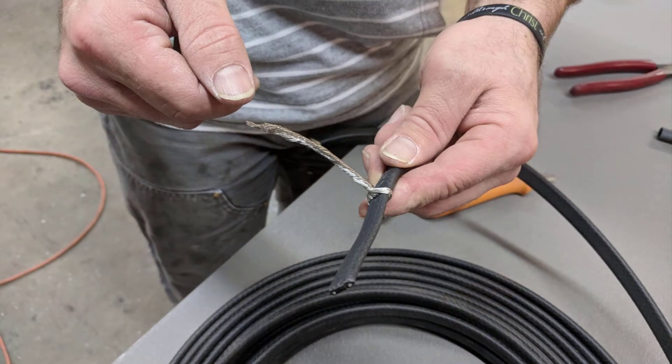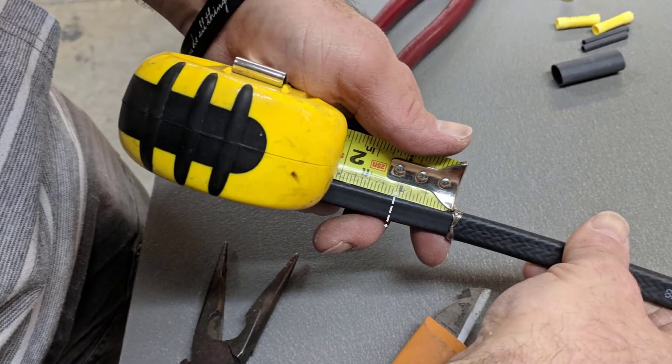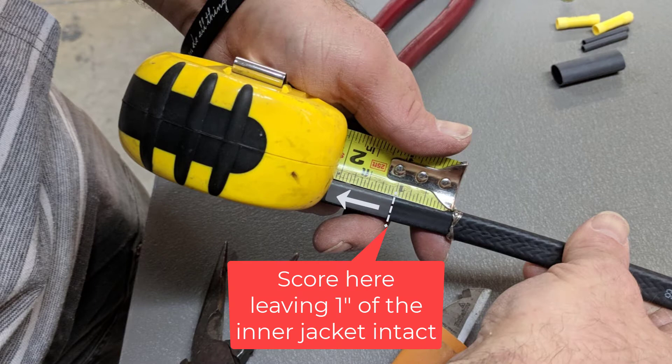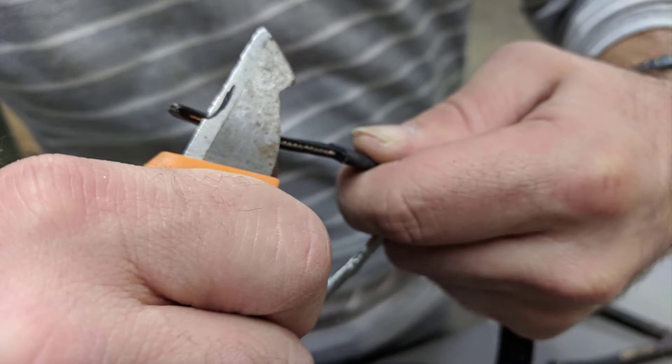Twist the ground braid on one side so that it becomes one continuous strip of wire. Measure one inch from the outer jacket score line and remove the remaining inch and three-eighths from the inner insulating jacket so that you have an inch and three-eighths of exposed core and one inch of the inner insulating jacket remains. Carefully trim away the outer conductive core along the edge of the bus wire, taking great care not to nick or cut the bus wires while doing this.